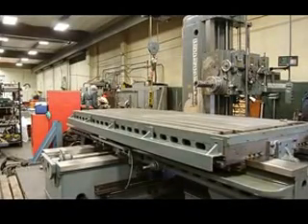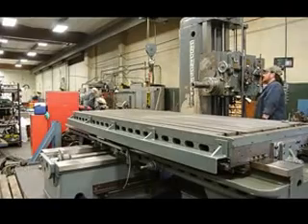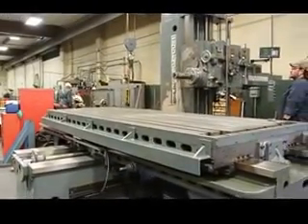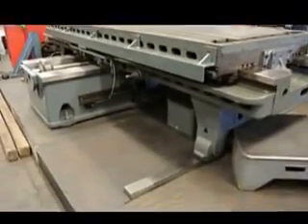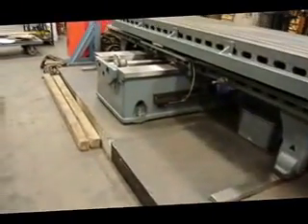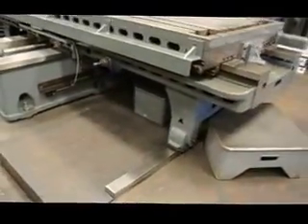I'd like to point out that this machine does, in fact, have 42 inches of vertical travel, 42 inches of saddle travel. It has a 20 horsepower main drive motor. It's a 220/440 machine that's currently wired at 440 volts. The overall weight on this machine is 39,000 pounds. Again, it's a hard way machine. It has the outboard saddle supports. It's sitting on a couple of blocks of heavy-duty wood, raising it approximately 5 to 8 inches, so the underside of the table is equidistant with the top of the outboard saddle support.